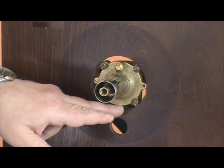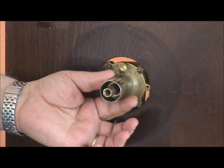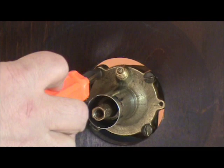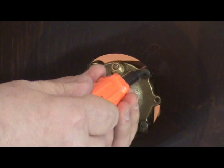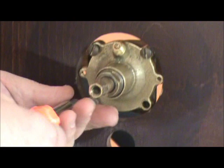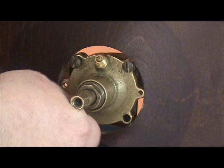You'll also find this valve is in the wall a little bit. You might stuff a rag — I'll show you — just so you don't lose your screws in the wall. Ultimately, what we're looking for is this assembly right here. This doesn't always come off this easy, and if it doesn't, bring it in and we can get it off for you or replace it. We're going after the bad yoke inside. After a period of time, this assembly will just wear from constant in and out, because of the material used at the time. After we get these screws out, this whole piece will pull out.